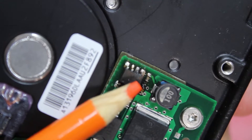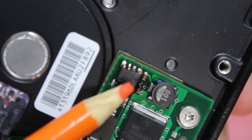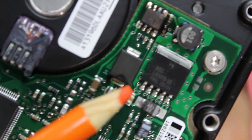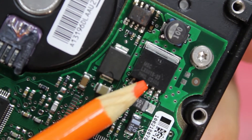That chip is so burned I can't even read the model number. You can see quite extensive damage to this processor — some of the pins have actually charred off. The other chip, which I suspect is the motor controller, has actually bubbled up, and some of the smaller SMD capacitors have completely browned. This is definitely damaged. There's also a voltage regulator here that could be damaged, though it can handle considerably higher current, so maybe it's okay.